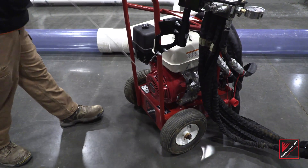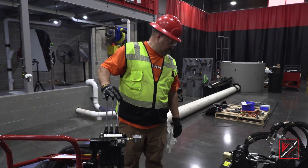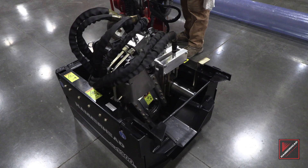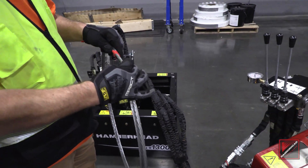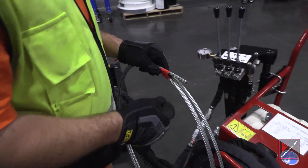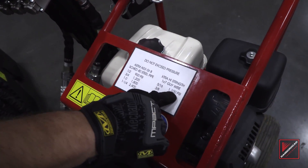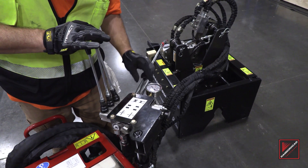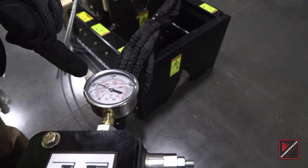Start the PB-13 and cycle the carriage to the rear of the machine. Identify the diameter of the cable. Using the PSI chart, select max PSI for the cable size. With the motion lever pulled, deadhead the carriage. Adjust the pressure relief valve to the max pressure.